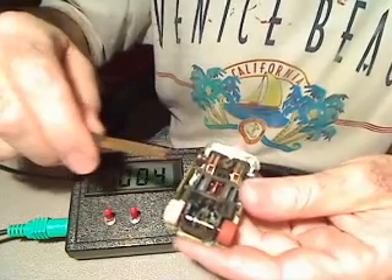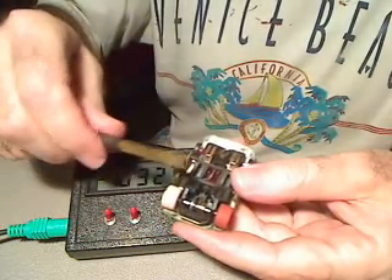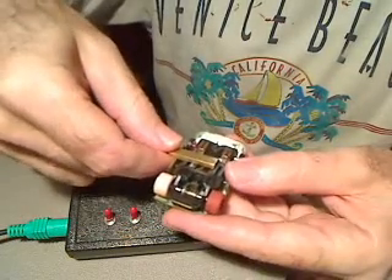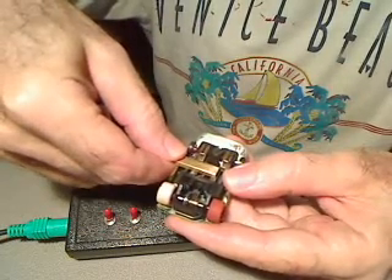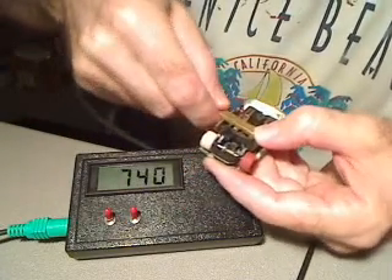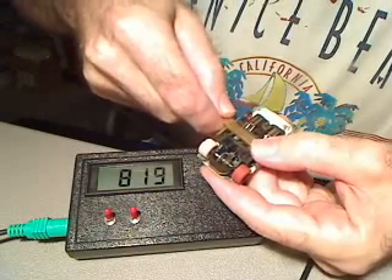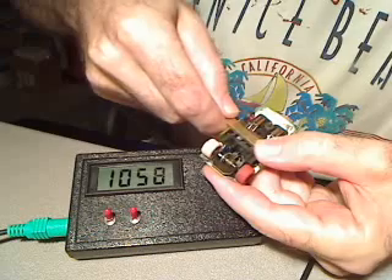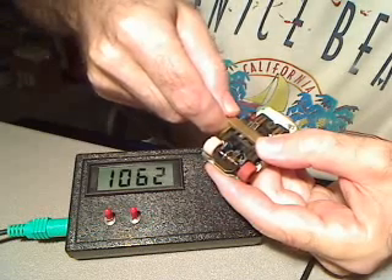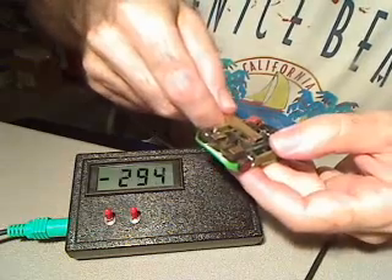If we can see this car — this is an old panther. This is the side of the probe with the notch that we're using, the scribe line. I like to lay it across the motor magnets. Just move it slowly until you get the highest reading, and you can do the other side.